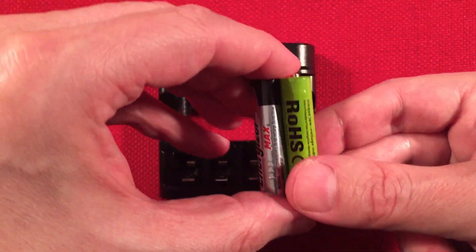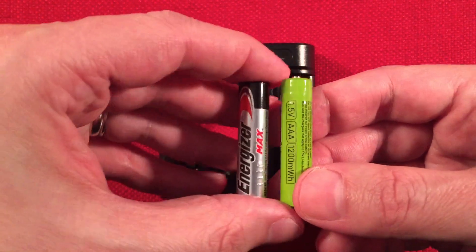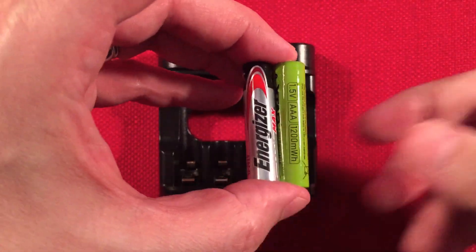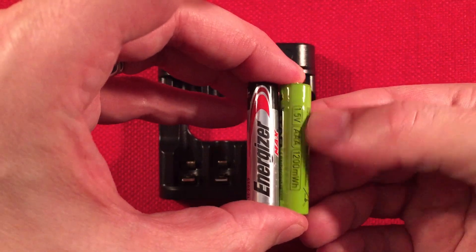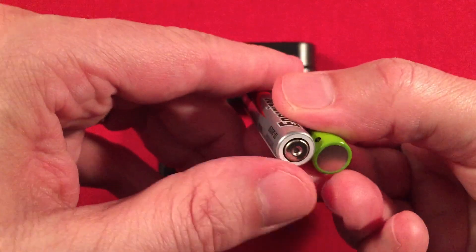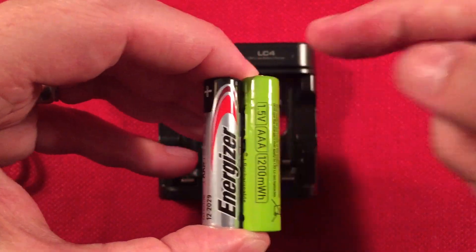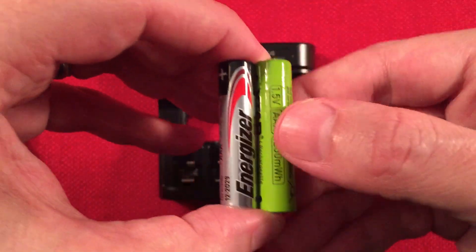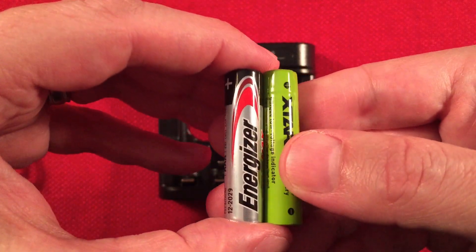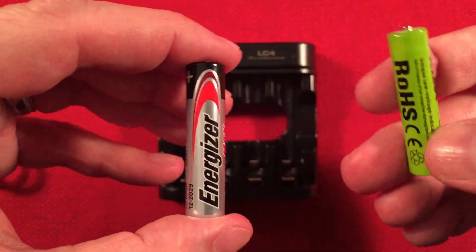For the AAA: the X-Star is rated at 1,200 mWh and the standard alkaline is rated at 1,800 mWh. Again, that could be internal capacity with a small DC-to-DC loss. The constant output is very cool — with no dimming. It's straight across; there is no dimming. It just starts doing that voltage change so you know it's time to charge up. Loving that unique low-voltage indicator.